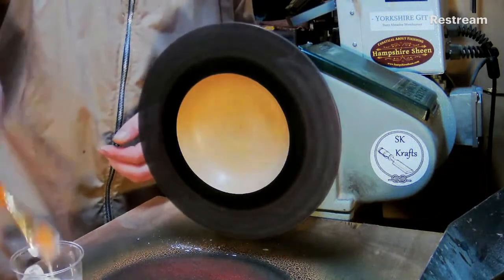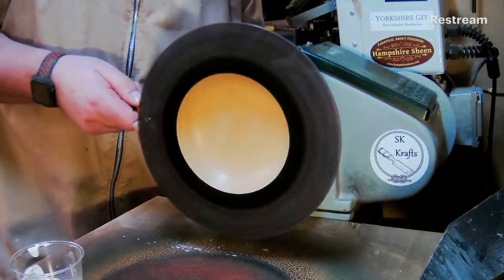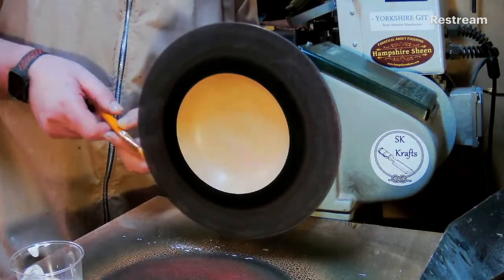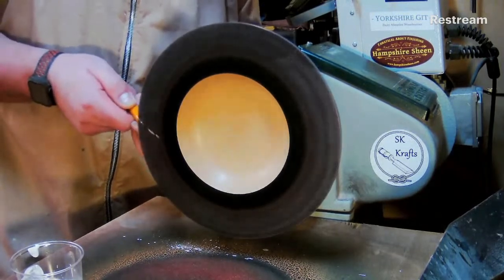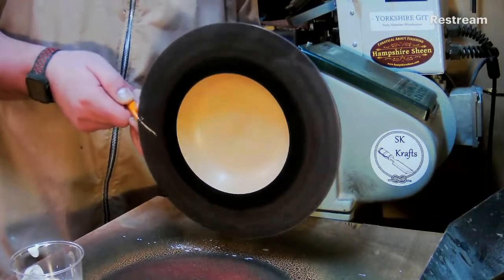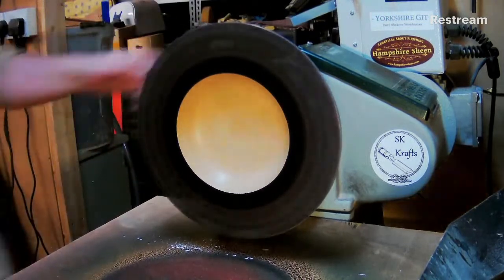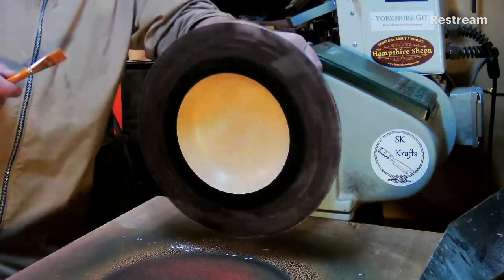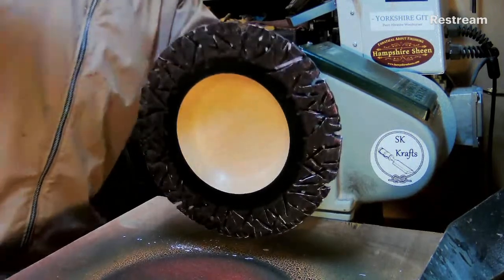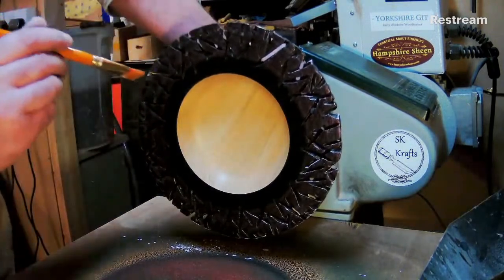Colin's asking how he could drill a glass bottle. You need a diamond drill. Either a diamond tip drill or a proper glass drilling drill. Bosch do a diamond tipped tile drilling piece, which is absolutely awesome for drilling glass. I had to put a cat flap in a piece of glass, and that drill went through with no problem. I thought you were going to say you had to drill through the cat. Well, if it fits.